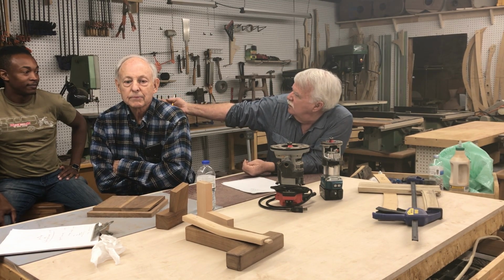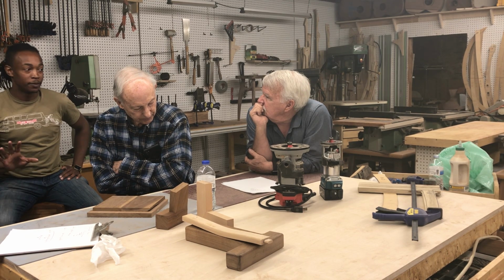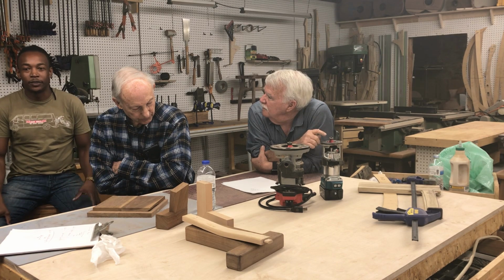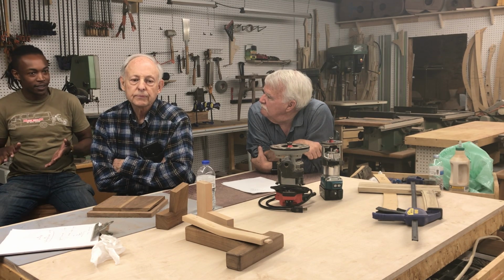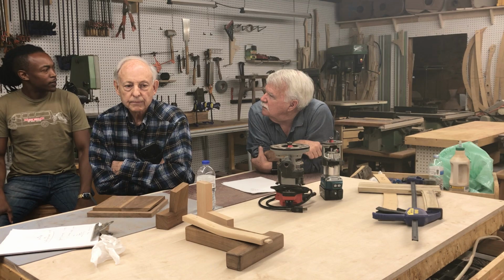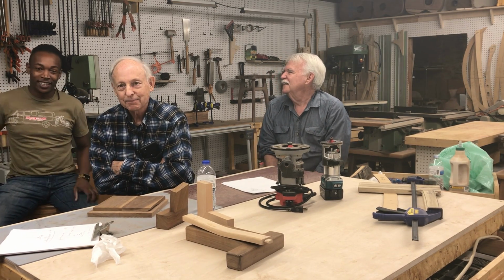Tell us about your experience with the track saw. It was a Triton, which is significantly cheaper than the Festool track saw. But to be fair, I was working with killer lumber, literally. Naturally salvaged lumber, dried naturally, some of it is really dense, and not every species of wood has that even grain density. So to be short, the lumber I was using killed the Triton track saw. It started to burn out, it was over a month. But this was an industrial space, so every day we're grinding that thing through freshly dried lumber.